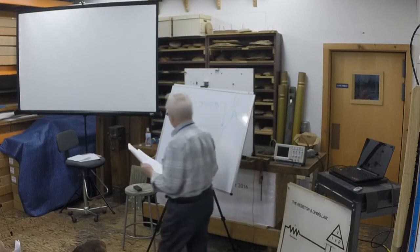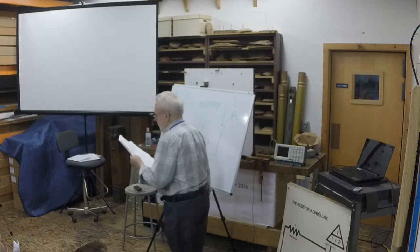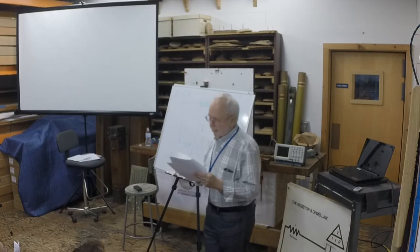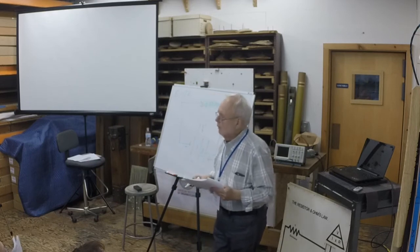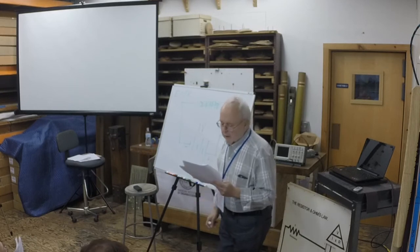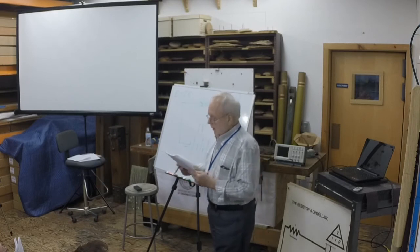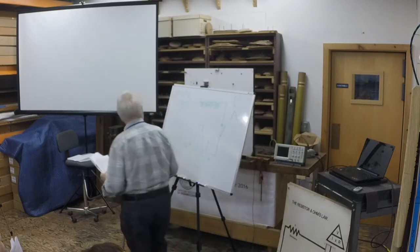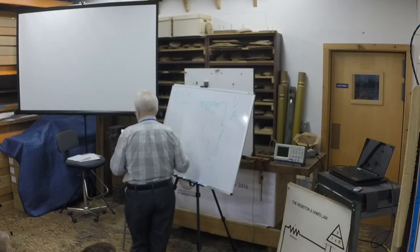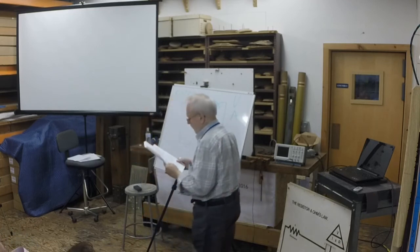If we were to draw it properly, we'd include something here to represent the soft iron core, so as not to imply that the coil is being wound on a soda straw or a swizzle stick or a dowel. Organ Supply kindly stamps resistance in ohms on the coils of their magnets. Just to make the math easy, let's call this one 100 ohms. And let's say the battery supplies a pressure of 10 volts.